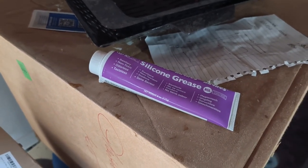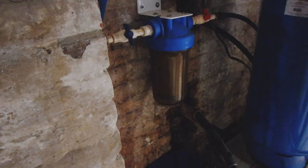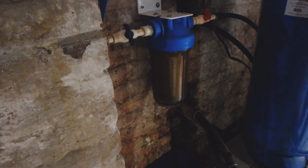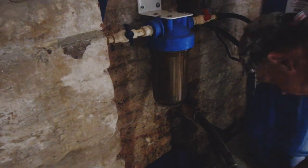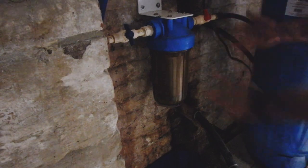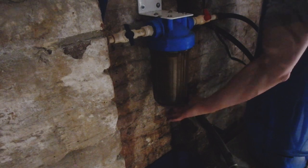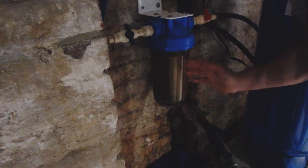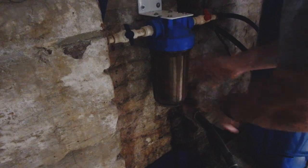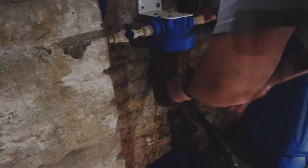Okay, so we went ahead and drained the water out of the bottom. You'll have a cap like this — drain the water out of the bottom. It'll come out; get these things closed. It'll take a minute — it might try to siphon a little bit first. Just kind of tap the bottom like a habit-trail bottle for a hamster and it'll start pouring out. Once it drains, break it free with your filter wrench — chances are it'll be a little bit stiff.